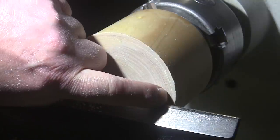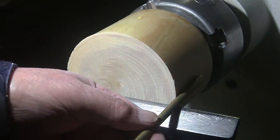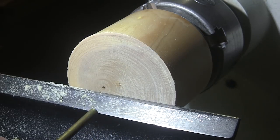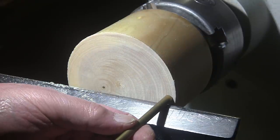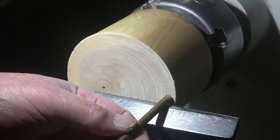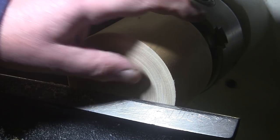I'm going to drill straight through — this will be the top, probably about three-eighths of an inch thick or so. Then I want to drill it down into the body some, and that's going to serve as a pivot point for the top to swivel open, get your salt out, swivel it closed. I might even make the brass rod proud of the surface — let it stick up just a little bit, maybe an eighth of an inch or less. So I'm going to take this over to the drill press so that I get a nice straight hole.